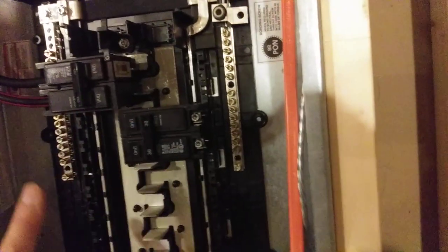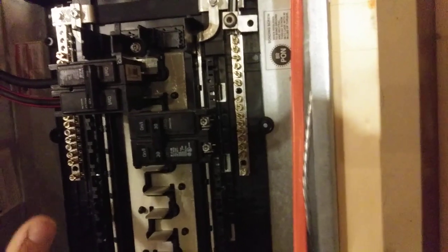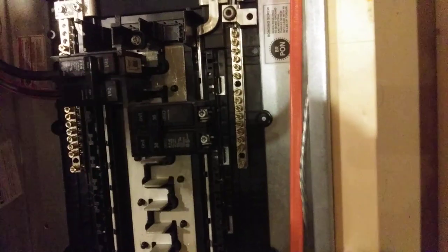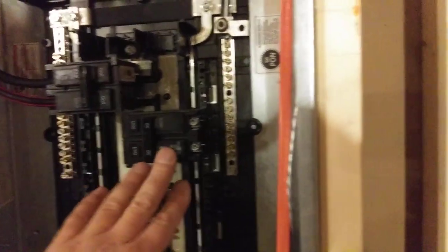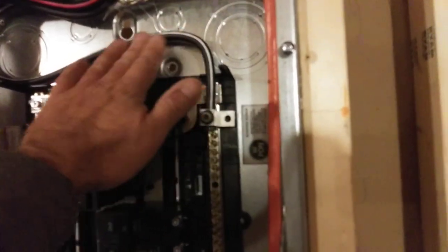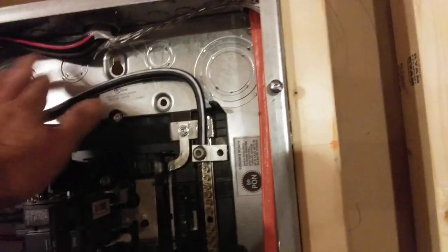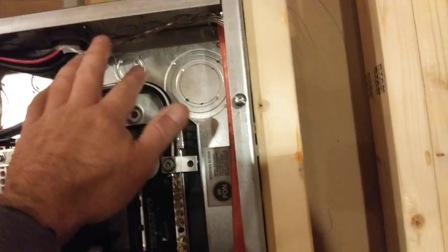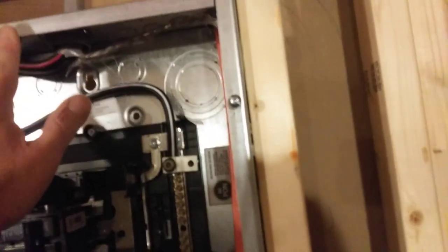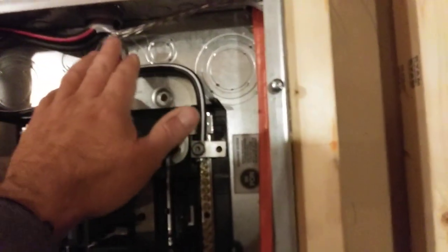That's hot and goes out to whatever you need — receptacles, lights, heaters, heat pump, whatever. For the 120 volt circuits, any leftover electricity in the milliamps will go back through this grounded conductor. The neutral and the ground line will be bonded at the main panel, which is by the meter, and that'll go to ground rods in the ground. But this ground line goes down to this bus bar and never shall the two meet.